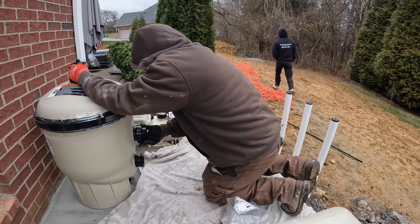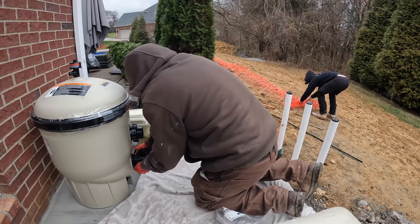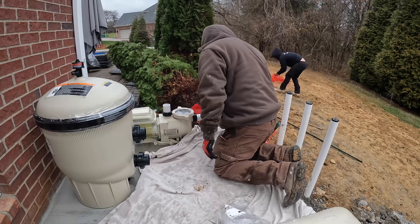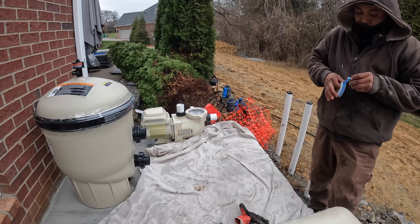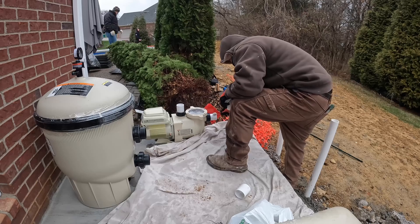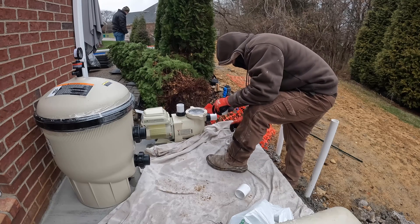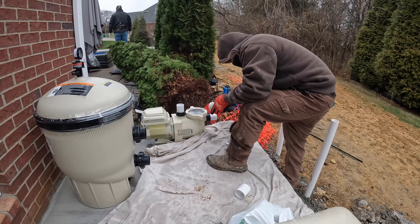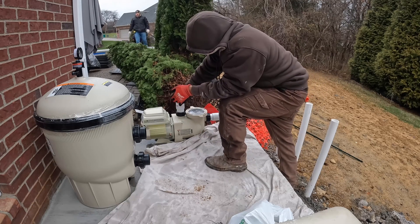Just a little explanation on the heater - it's not that difficult once you get the rest of this, you'll get all of it. This is a 10,000 gallon pool, pretty small - it's a 30-foot Freedom in total length. Making sure everything is threaded on there with a wrench, making sure thread tape is on nice and snug. You don't want to over-tighten those because they're plastic. Those are the fittings that come with it, and then Jesus is going to put couplings on them so he can tee up.